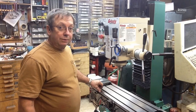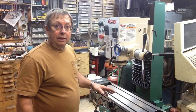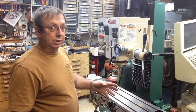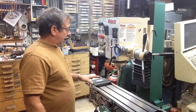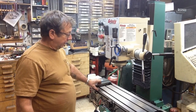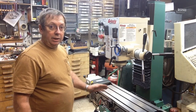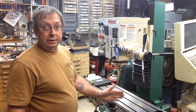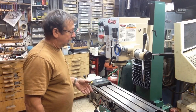And when I swept across the front edge of the table, I fast-forwarded through a lot of that just because it was boring to me, too. I know it's going to be boring to you watching it, or was boring to you watching it, because you would have seen it before this part. The front of the table, when I swept it, it ran fairly true up to probably a third of the way across in this direction. It ran spot on. From there, it very slowly started to climb to the end.